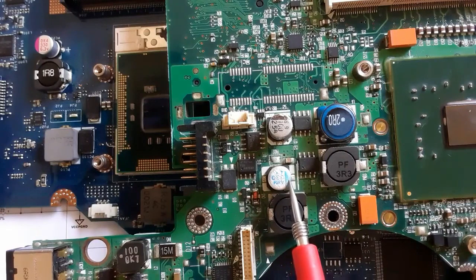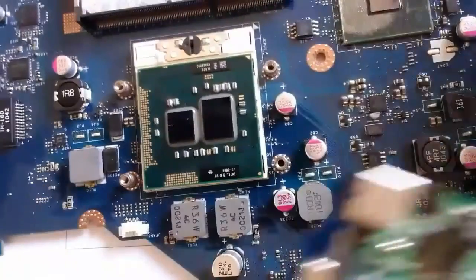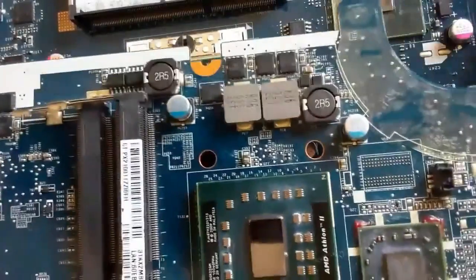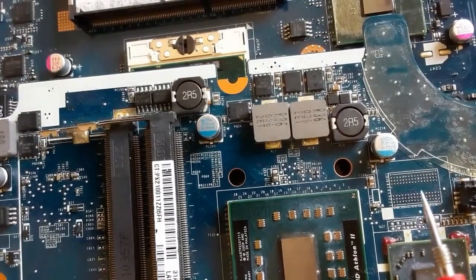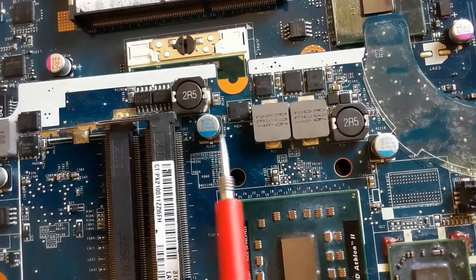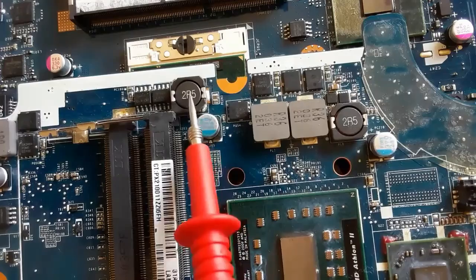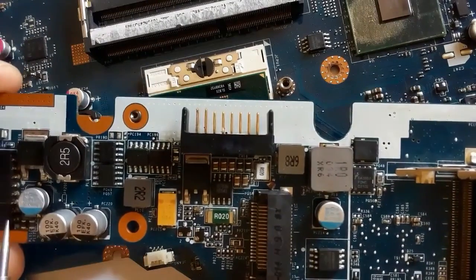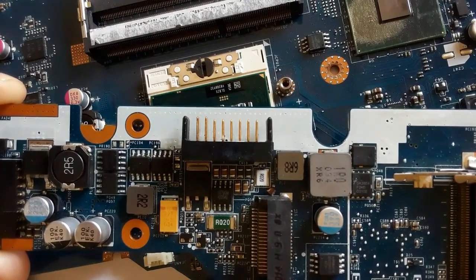This blue part is the minus and the other part is the positive terminal. For this kind of capacitor, you must respect the polarity when installing it. Unlike a ceramic capacitor — which you can solder randomly — for electrolytic capacitors you must respect plus and minus. You can always find these capacitors near the inductor, because this is a filtering capacitor.